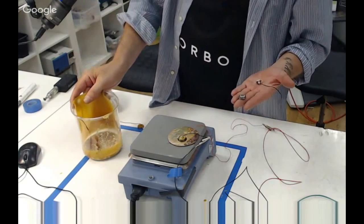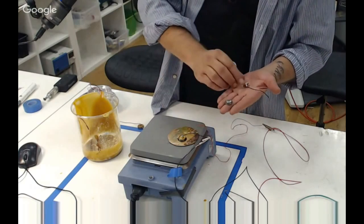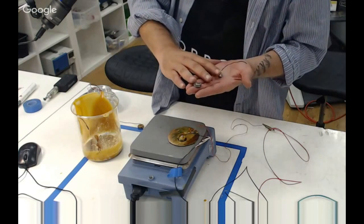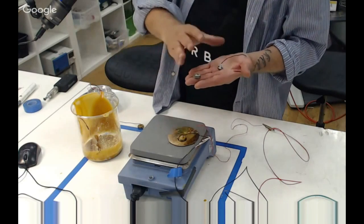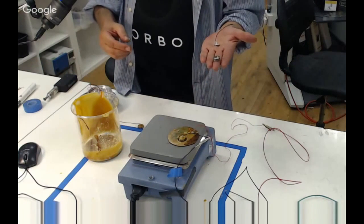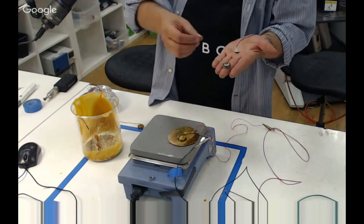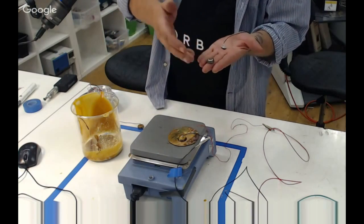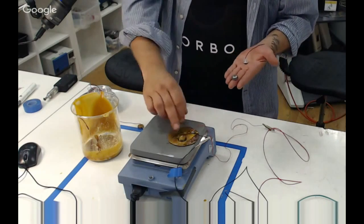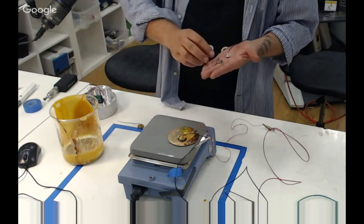These could be sheets, they could be basically any physical format, but fundamentally it's two different metallic components and an agent or a gel. So in that way, if anybody's in any way technical, it looks identical to a galvanic cell. Yes. And a galvanic cell or a normal battery is something chemically eroding the other components. What's different here is that the gel that we're using is entirely inert, has no chemical interactions.